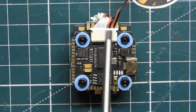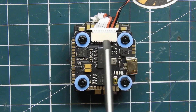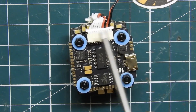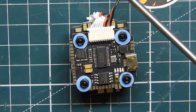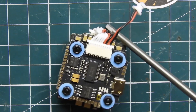On the 4-in-1 header, we do have current telemetry, so it does have current sensing. These pins here are all your motor pins. You also have buzzer plus and minus — you can cut that little plug off and connect it to a buzzer if you want to.